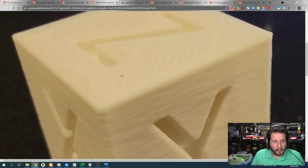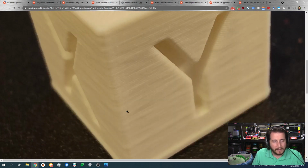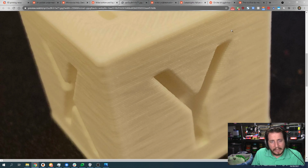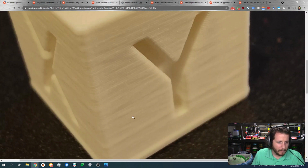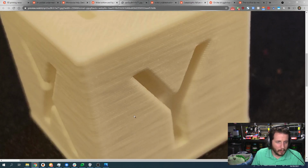And it's difficult to see that top layer, but it does look like we've got some shearing from the nozzle, and that still tells me potentially over extruding. It looks like she might be a little bit hard right at the top as well, but looking at the rest of it, it might be over extruding, but you know, that could be Z-wobble.